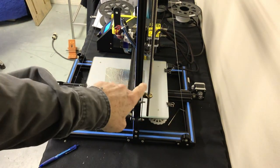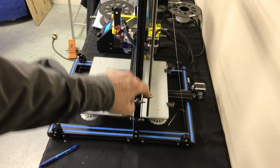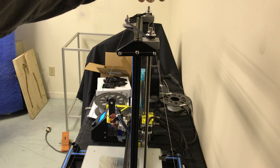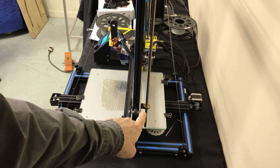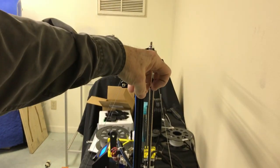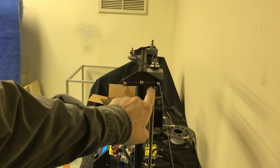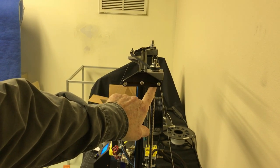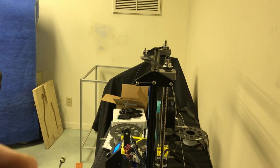If you screwed this onto the shaft up about 5 inches or 4 inches up, you can then lift this whole shaft up with that connected to it and do the procedure that we're doing right now. Once these screws are in, once everything's there like that, this may stick up. You just simply screw it down till it gets to the spot where it is right now. Your collar will be loose on there. Slide the set collar that's right here underneath up and give it some tension. Keep it in place while you go through the rest of the procedure that I outlined later in the video, or earlier in the video, whichever one comes up.